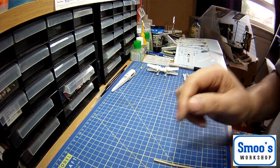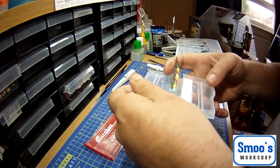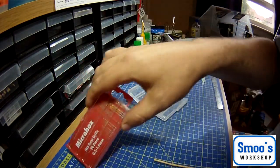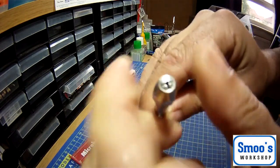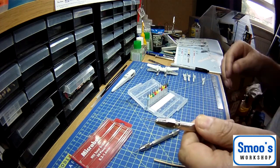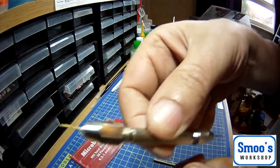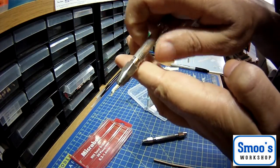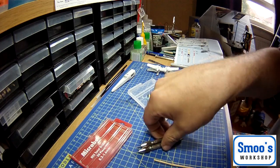Because I'm going to be modifying stuff, I'm going to need to drill little holes here and there. You can get little twist drills - these are your standard hobby twist drills, going in really small sizes from about 0.3 to 1.6 millimeters. You get a thing called a pin vise, which is basically a little collet. You put your little drill bit in there and tighten it up. If you want to drill a hole through something, you just twist it by hand. You do get fancy ones you can pump up and down, but I find I get more control with the hand version.